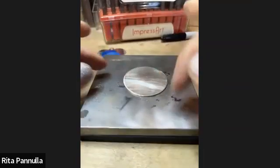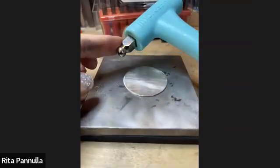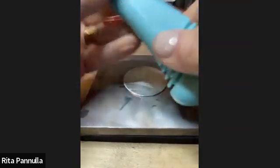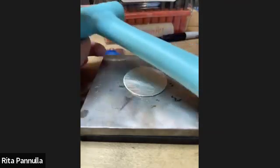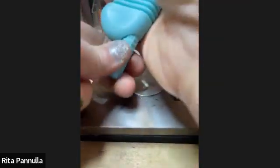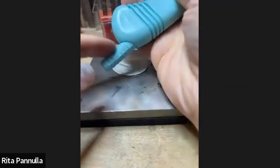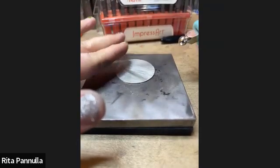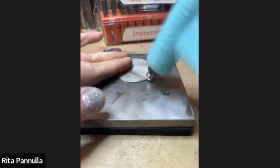First and foremost, I'm going to work on my edges with our multifunction hammer. This hammer is great for the simple fact that all you have to do is unscrew your bottom and your different texture heads pop out. You put it right in with the notch facing down, and give a nice, healthy squeeze, making sure that you are really firmly in place. Then take your two fingers, put them on your blank the way you feel comfortable, and take that ball peen head and texture the outside.